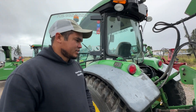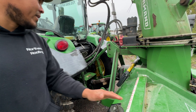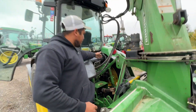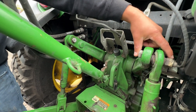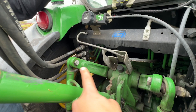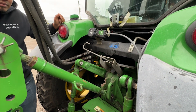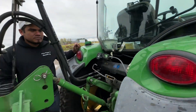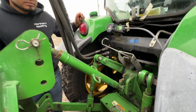There is a lot of effort that the tractor is doing with all this weight in the back. Many of the pins will suffer, especially on this side here — I had to get a very strong bolt because they were just snapping the factory ones. These two pins would always break on us. Over the winter we realized a lot of our 4066Rs — we bought them slightly used and we have tons in the fleet — were a really rough ride and we always broke a lot of rear-end parts.